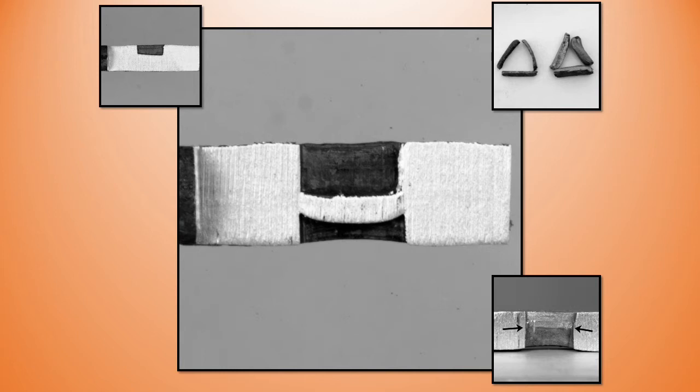Here's our result. Note how the lower hole is slightly longer than the top hole — that's because of the migration of material. The slug produced by punching to the middle is slightly thicker than the slug produced by punching to the anvil. I'm just about to shear this out — I get a nice clean hole when finished with a little bit of rag, but not as much as I'd get using something like a slitting chisel.